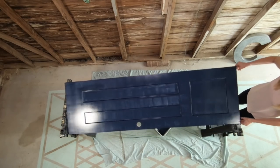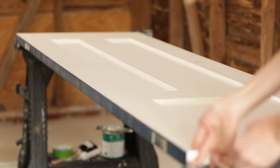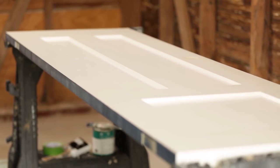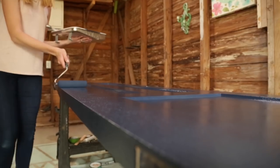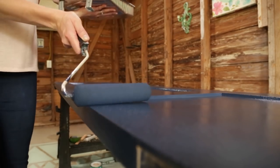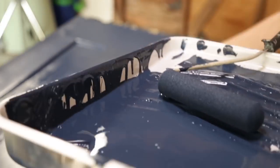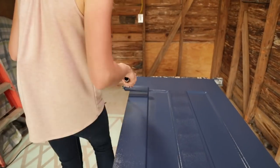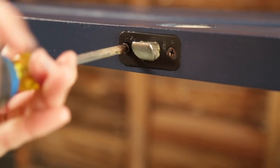Once you're done with the first side, pick up the door with the two screws at the top and rotate the door on the screw attached to the bottom. Then you're ready to paint the other side. I always like to apply the paint in small strokes, but then immediately go back with one long roll over the entire surface to smooth it out. The second coat always goes a lot faster than the first. Let your paint dry a few hours before reattaching any hinges and doorknobs.